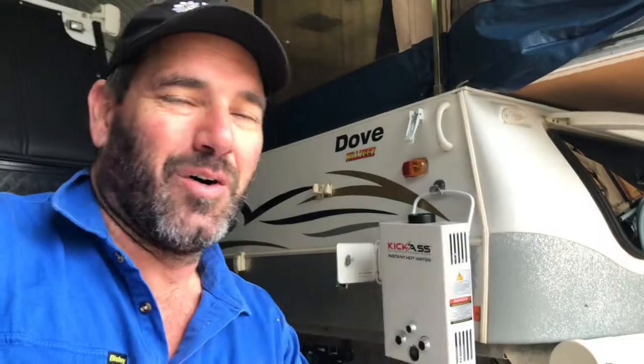Good result. The Jayco Dove now has a new gas bottle holder, new regulator, a couple of new bayonets, a new pump, and the Kick-Ass hot water system. The water side you can DIY if you're handy enough, but it is time consuming. The gas side you need a licence — you need a licensed gas plumber so you're covered by insurance and they take responsibility if anything goes wrong. If you like what we've done, we've got a full page on beautifulplumbing.com.au with heaps of camper case studies. If you're in Perth or WA, give us a call. Thanks for watching.